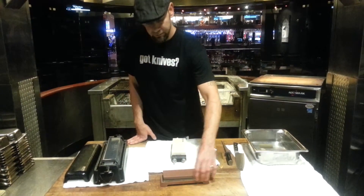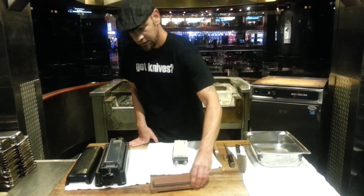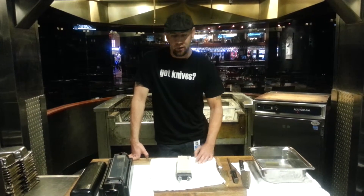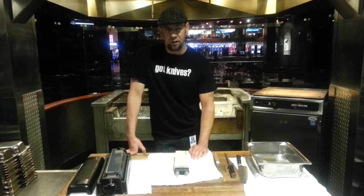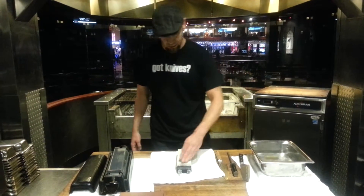Here's an example of a Japanese whetstone. This one is a 1,000-6,000 grit combination stone made by King out of Japan. And the one I'm going to be showing you today is a 10,000 grit finishing stone. For using these whetstones, some tell you to soak them for 12 to 15 hours, while others you only have to soak for 15 to 20 minutes. These two that I have you only need to soak for about 15 to 20 minutes to make sure they're wet and have retained enough moisture. While you're using them, you have to constantly make sure you have a good amount of moisture on top.